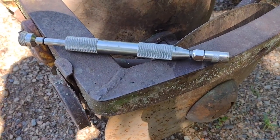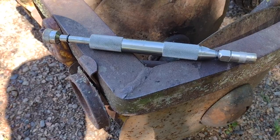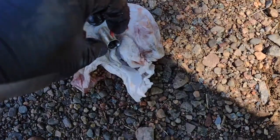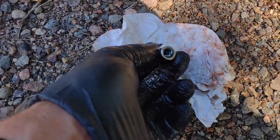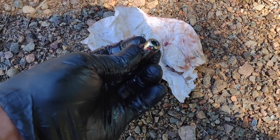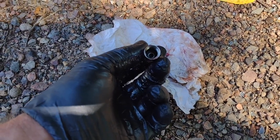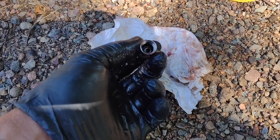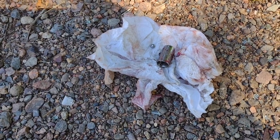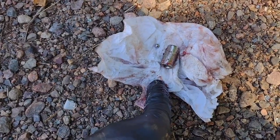This thing is kind of crude but I gotta give credit where credit's due — it did get results. Here's what I learned trying it out. The main thing it goes through is grease couplers. It's forcing thousands of pounds of hydraulic pressure through these things and they just plain and simple can't take it. You can see that one's missing a couple jaws and there's a rubber gasket in there — kind of like a goofy O-ring sort of deal — that blew out on the second grease zerk I attempted, but somehow this thing still held pressure and I used it on another zerk after that.